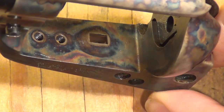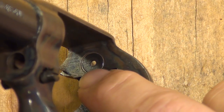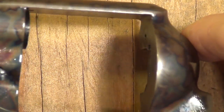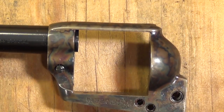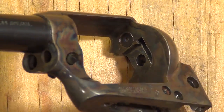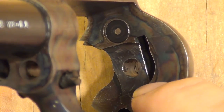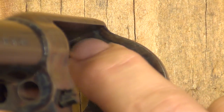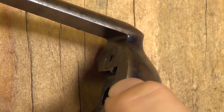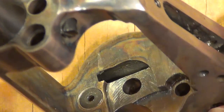Here's a Colt frame from the early 1980s. I had one from 2009, very similar in terms of the machining. You've got some machine marks that are certainly evident in it, but look at those lovely color case. You can see the recoil plate staked in — on all Colts and also on USFA and Standard — with a small hole for the small diameter firing pin. Typically you'll have a fairly square cylinder window on a Colt, carefully broached out. You can see the step in the recoil shield where it goes from generous headspace to tighter headspace, represented by a little lip there. It's fairly smooth and ramped so rounds don't catch on it.